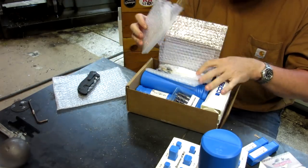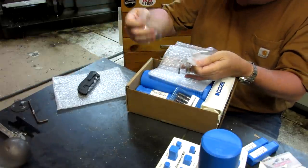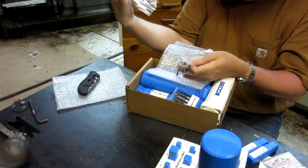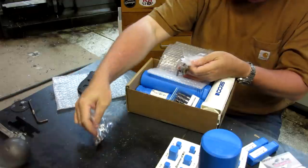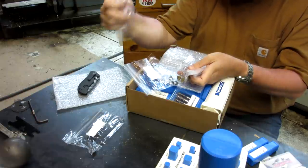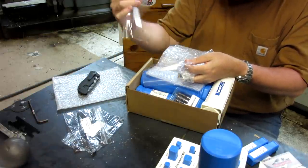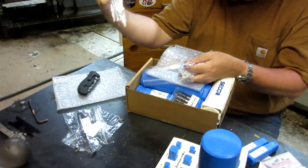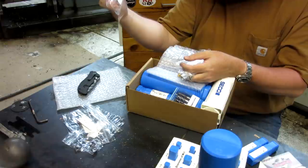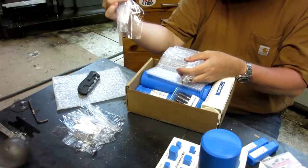Now you're talking some meat here. Some inserts, various types and grades. There's a DNMG. It looks like a positive. A DNMG 422. WNMG, which is a 433, which is a great size right there. Here's some different. There's a CNMG 434. Nice big nose radius on that. So we get the pacemaker going, that's going to come in real handy. Another DNMG 433. A couple of WNMG 431s.